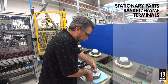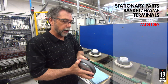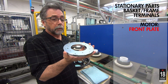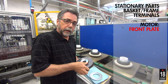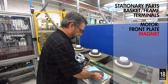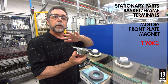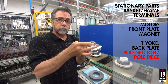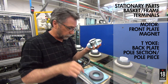Looking at the metal and magnet parts of the motor, we have three components. We have a front plate — it's like a giant washer where the flux density gap is in the center. We have the magnet; in this case, a ring magnet. It's a ferrite, sometimes called ceramic. And then we have a T-yoke, because it looks like a T, which includes a back plate and a pole section. And then very often a tapered pole plate, where we have an undercut under here that improves how the flux will flow through the gap.